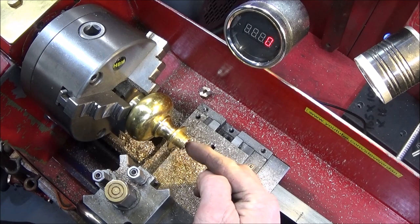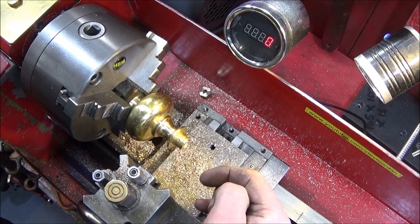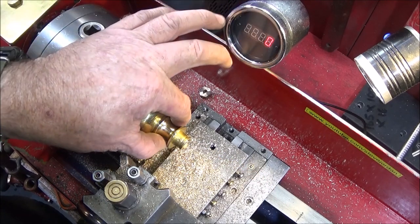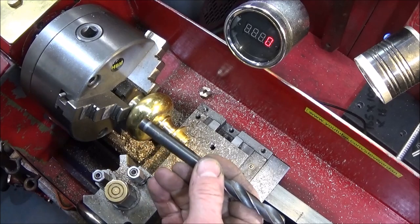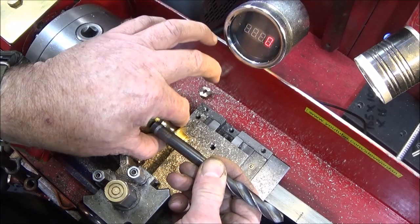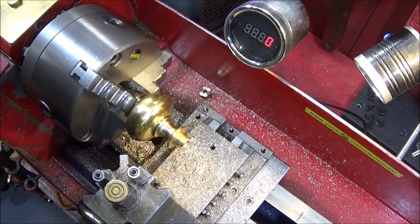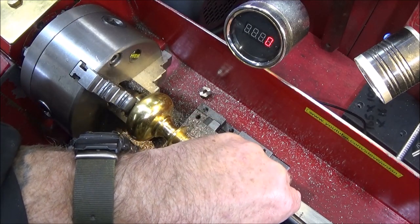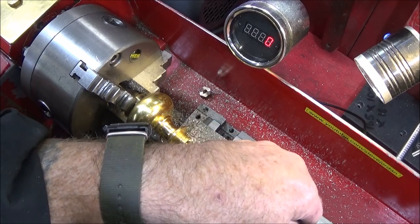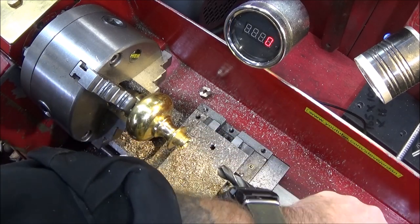And to clean that hole up and take that square out, I'm going to have to put a quarter inch BSP thread in that one. And the thickness here is okay. If I put the core diameter up to that, I can see I've got nice thickness on the wall still. So I shall put that core diameter down and then tap it for the quarter inch BSP.